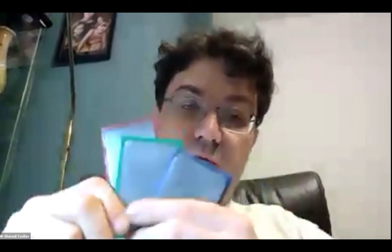So I prefer to use cards. For instance, if I sharpen my gouges or other tools, I would sharpen once and probably go through five to ten cycles of resharpening with my diamond cards. It's just so much easier and faster. They're just in front of me on the shelf. I just reach out with my hand. It takes me about 20 seconds. And it saves me those critical minutes going on the journey to my bench grinder, setting it up and doing all that stuff. The only thing is, I would suggest how to make the whole thing a little bit easier.